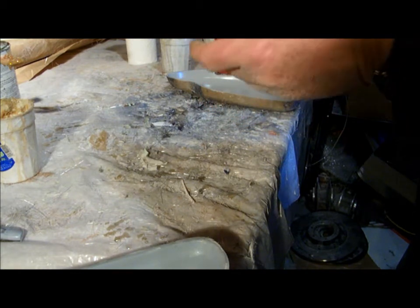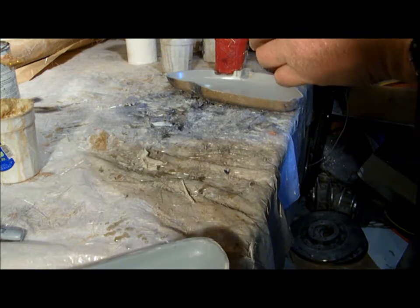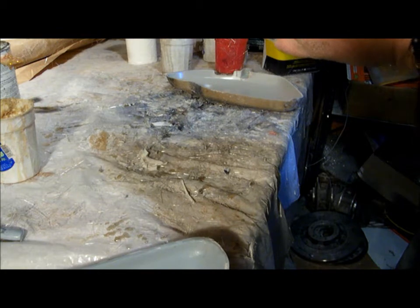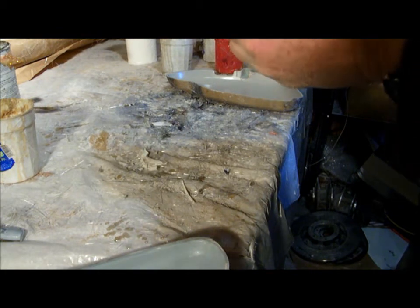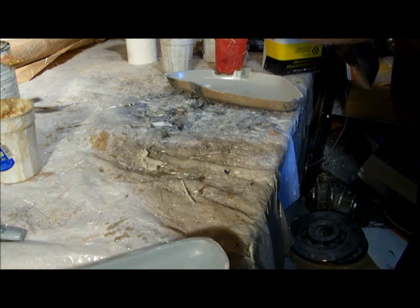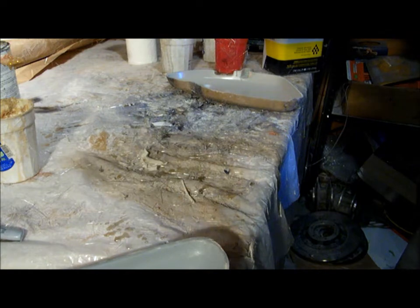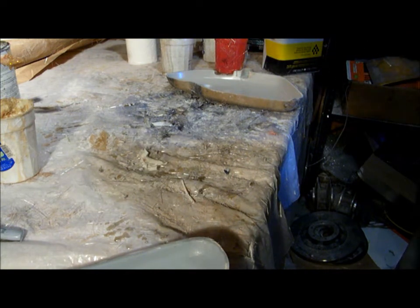I see not all of the clay oozed out when I heat it up, but you can see it's kind of shiny — I just painted on super glue. So that way it can pour out and I can heat it and it's not a problem at all. And then just some lacquer thinner or acetone eats the clay, so they'll bring it out and I'll just scrape this off.